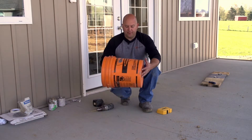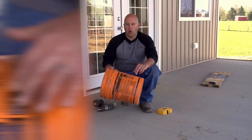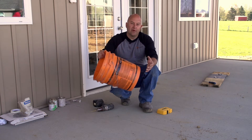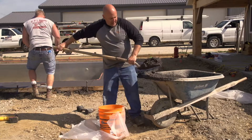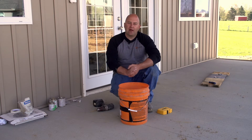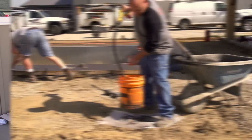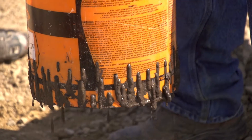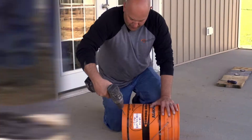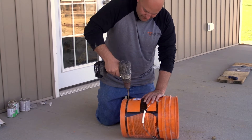For this week's technique, we're going to be drilling holes in a bucket - about 50 to 60 quarter-inch holes, about a quarter of the way up. Then what we're going to do is put some of the leftover concrete in the bucket, vibrate it, and that's going to separate all the fine stuff. It only lets out through those quarter-inch holes the good stuff we want to slurry - it takes all the big rocks out. We're going to put holes on the sides and also on the bottom of the bucket.